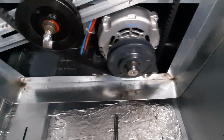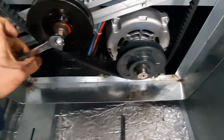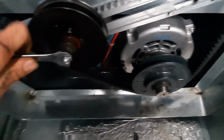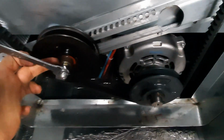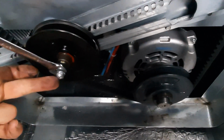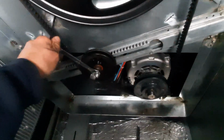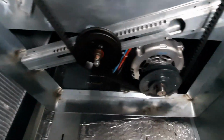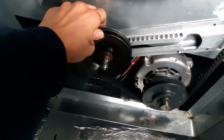Let's go ahead and get this adjusted. I've showed this 100 times. These are easy to adjust with these idler pulleys. If you turn the right way, that'll adjust your tension. And then you lock down that inside nut and it'll hold it in place. Don't lock down the outside nut. The screw will actually bust through the end, and then you'll never have a hell of a time adjusting again. Alright, so we're adjusted. I got good tension on my belt, not too much. These idler pulley bearings will wear out if you over tighten them. It's like that one's got a little movement in it already.